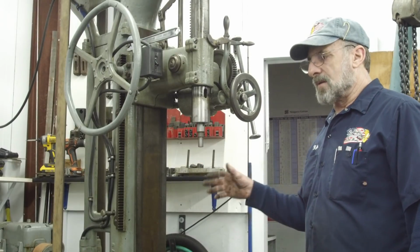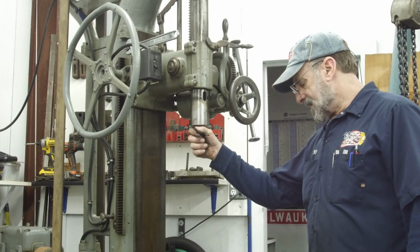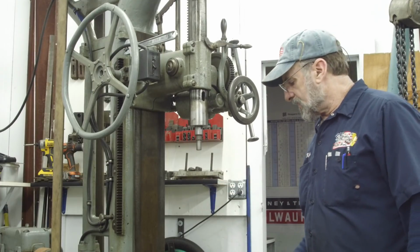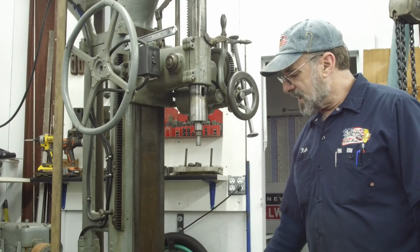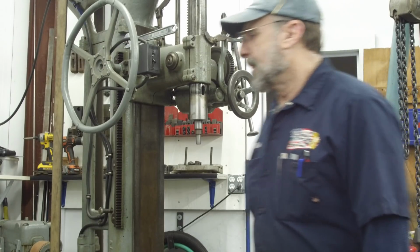Now, if we were exactly sure in lining this thing up 100%, this old drill press has got a lot of play and everything else, so it'd be really pretty hard to get it to be in direct on line 100% with this. Well, by running the universals, we allow it to track and create a center that we're creating off of the original part itself.